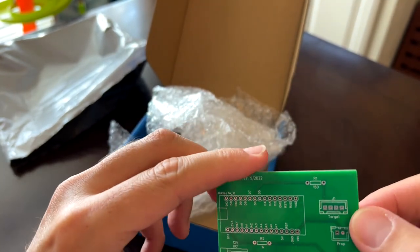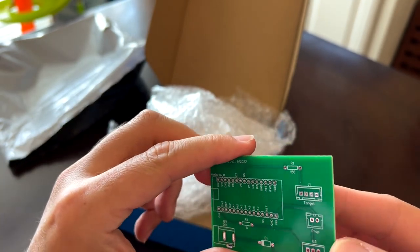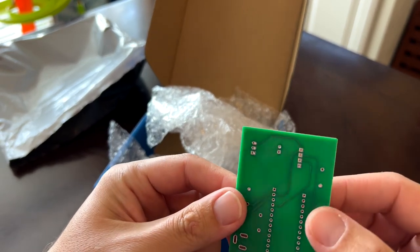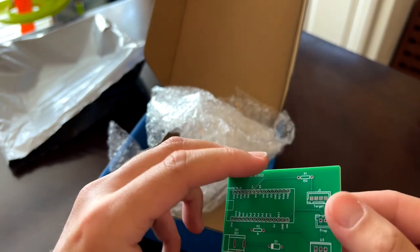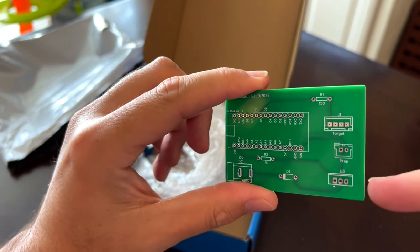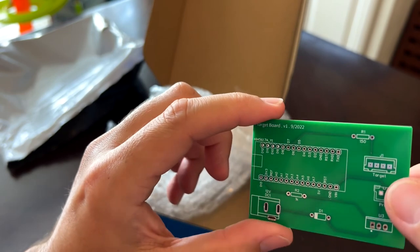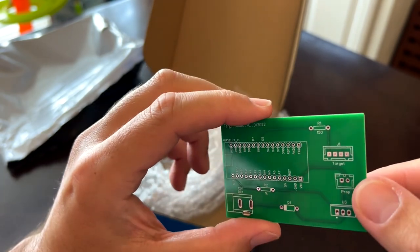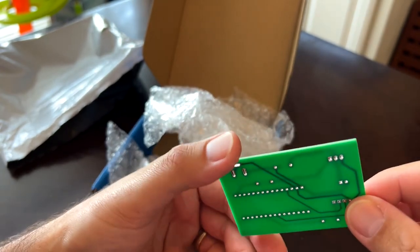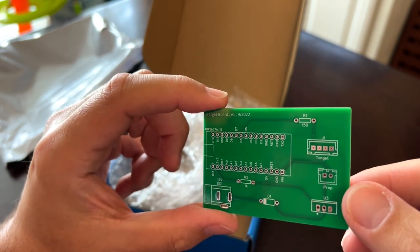And I noticed on this connector up here, it has different pads, and I can't tell if there's a hole all the way through or not, but that's not gonna work how I'd hoped. Basically, these guys are the other two connectors, and they have what I expected, and this one did not. I should have paid closer attention to that, but I am wondering if maybe I could just drill those out and solder through there, if that'll fix it for me. But I'm kind of disappointed on that one. I wish I would have caught that, but hopefully they'll still work for me.